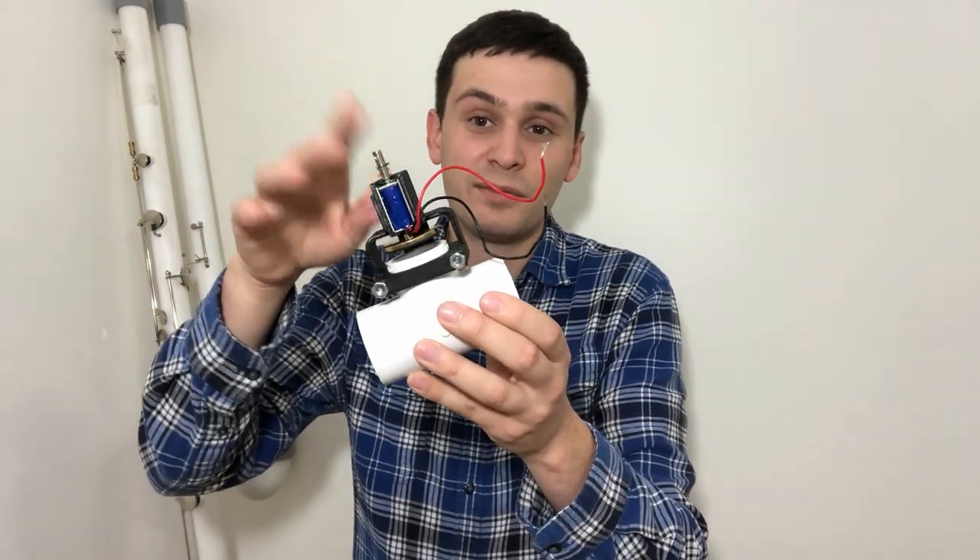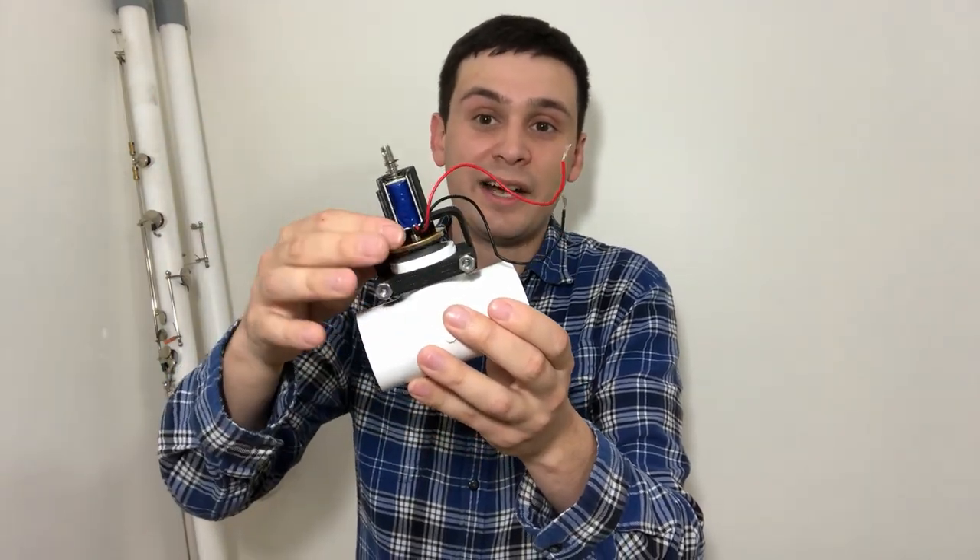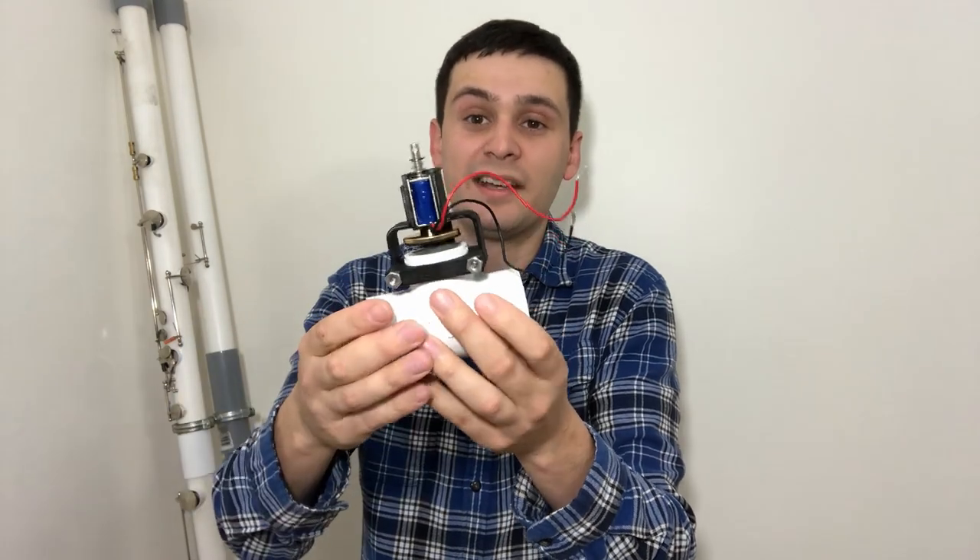This can simply be controlled with a button that simulates the look and feel of a traditional clarinet key. With this setup, I can just make 22 or so of these solenoids, which are very easy to make — you just have a standard off-the-shelf solenoid, a 3D printed part, a pad cup that can easily be purchased, a pad, and a piece of PVC fitting. Most of the parts are standard off-the-shelf, and I can use the same design for every single tone hole on the instrument with the exception of the register vents. It's simply a matter of building a control interface — most likely clarinet keys or possibly alto clarinet keys with contacts that open and close circuits to control a microcontroller, which then controls the opening and closing of all the tone holes.